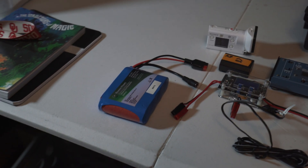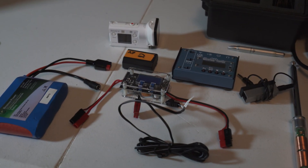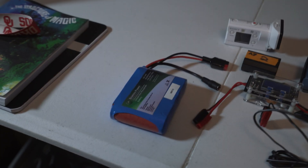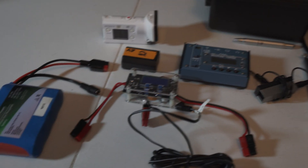I finally have some good weather and a little free time, so I'm going to try and use the Mountain Topper. That's my voltage regulator and all the wires - I kind of have it laid out here. I'm going to try to get this working with this little tiny compact, easy-to-put-up antenna from Elecraft. I got my little battery. We need 12 volts, not 13.8 - that's why we have the voltage regulator.